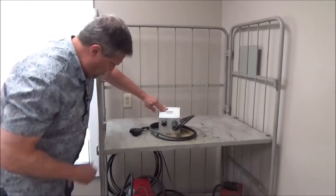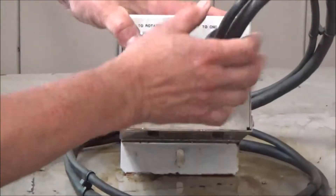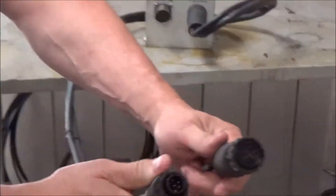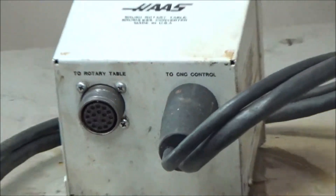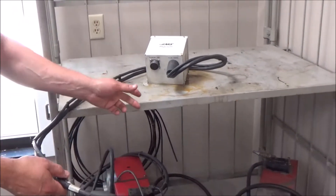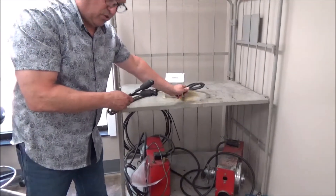Say you had a brushless drive machine and you knew it, but you had one of these brush drives. This is a Haas converter. Two cables mean brushless — there'll be one larger cable interface and one smaller cable interface, just like that. That's brushless. It says 'two CNC controls,' so these would go into a brushless machine control with one output to drive an older brush style. So you could use this converter to drive a brush drive rotary table with a brushless Haas machine.